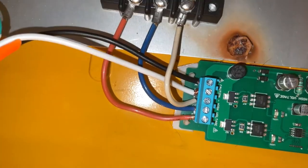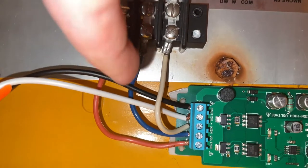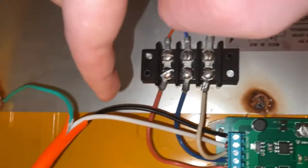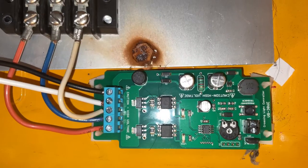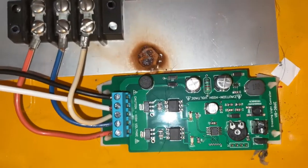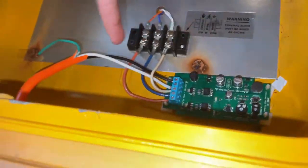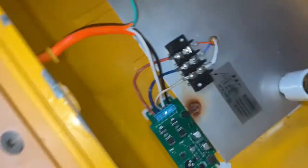On the controller, you can see it says you have to connect the right matches. The wires are red, blue, and white. These are the wires connected through here. White and black are coming from the extension cord — you have to buy an extension cord — and the green is going to be for the ground. It's basically the same thing as with the LED insert. There's the controller. These wires are normally connected through here, so you have to disconnect the wiring from here, then disconnect these three for now. Do not disconnect the ones connected to the socket and light bulb socket. Just disconnect those three using a flathead screwdriver and leave them on the side for now.